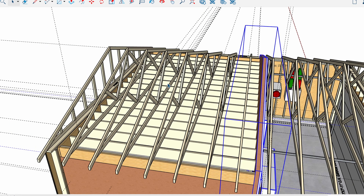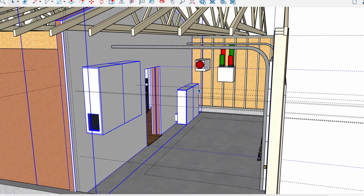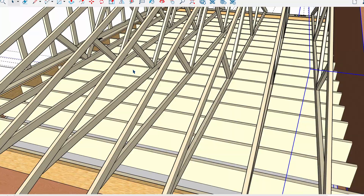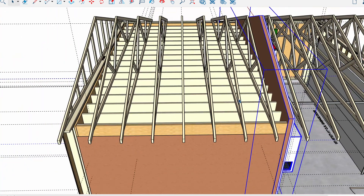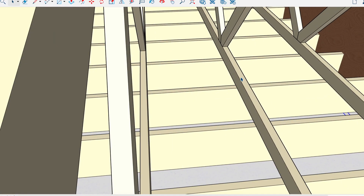If you're willing to sacrifice a little bit of ceiling height in your garage, you can circumvent the roof altogether — which, in my opinion, is the best way to go. In this project example, part of the garage is used for storage, and we're putting all of our baffle boxes and mechanical systems over there. What's really unique is we have pre-engineered roof trusses, and we're actually going to leave a small gap — about a quarter of an inch — so the studio ceiling doesn't touch the exterior beams. This means we don't have to worry about the load weight on the bottom of those joists.